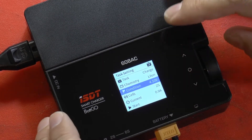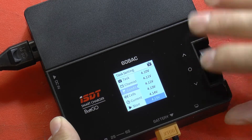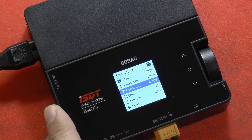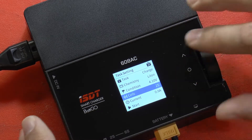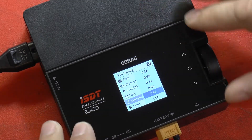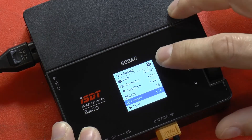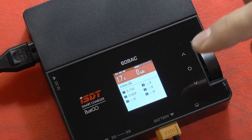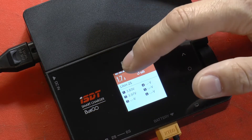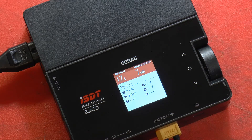After setting the chemistry to lithium-ion, we go down to the condition, which is the voltage we want to set the cells at. These cells could charge up to 4.2 volts, but that doesn't appear to be an option here, so we'll leave this at 4.1 volts — that gives you a little less charge but will help extend the life of your batteries. There are two cells, and the charge current in this case is 1700 milliamps, so let's bump this up to 1.7 amps. Now all of our parameters are set and we can hit start.